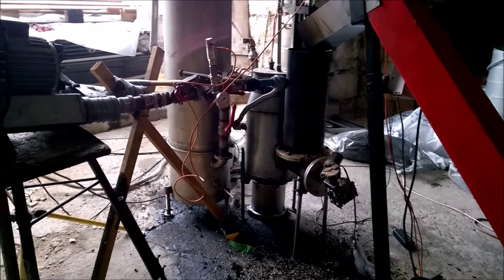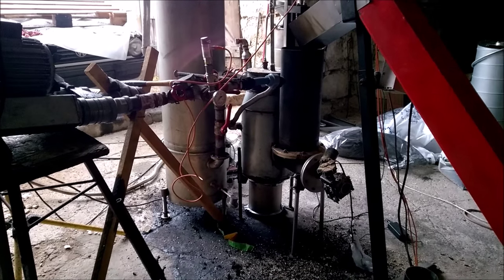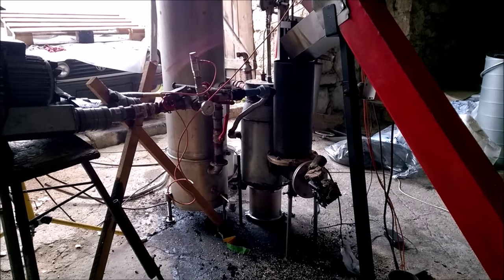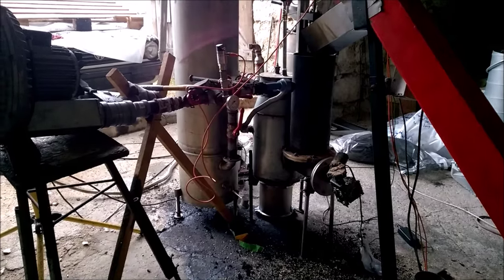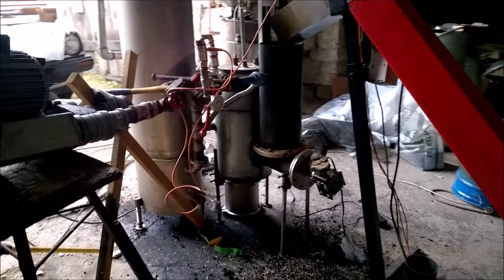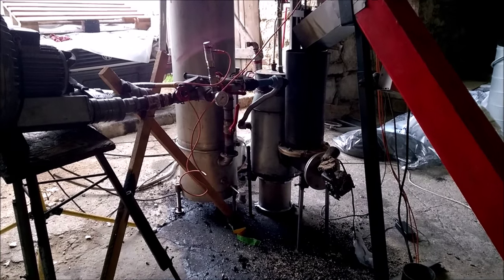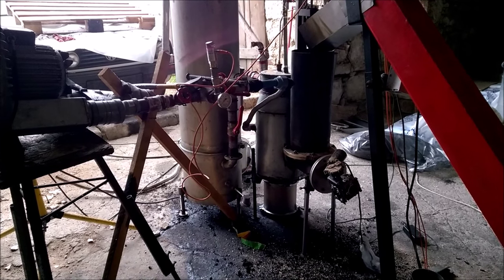Continuous running is the key word, because most of the gasifier designs on the market, Imbert types, FEMA, etc., are never designed for continuous running. They run a few hours and then they are shaking or cleaning out. We are aiming at a gasifier which can be run unattended for days and days without any touching, without any clean out. See further in this film how this 50-hour test went.